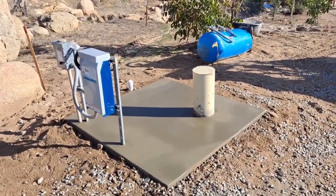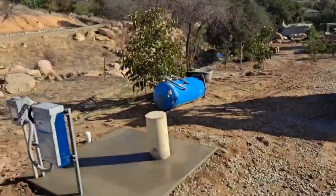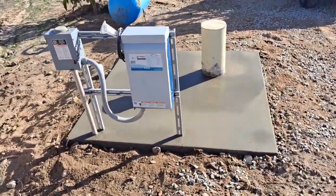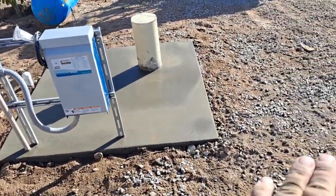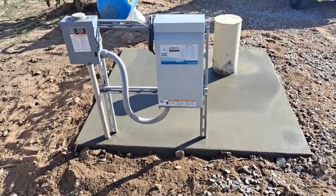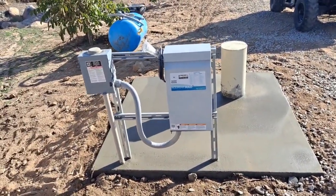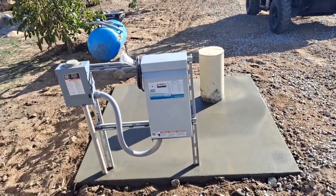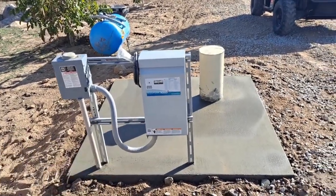Concrete day is over — it looks like maybe 3 o'clock. I did pretty good. Super happy with how it turned out. I just pulled the forms — maybe a little premature, but it's hardened up enough. This is pretty much the finished product. There's the 60 amp disconnect, but it's really only got a 50 amp breaker up on top. It loops in and powers up this variable frequency drive, which is going to change it over to three phase and do all the controls of the pump.